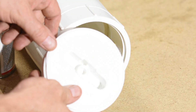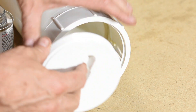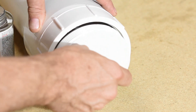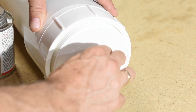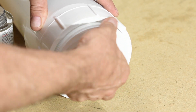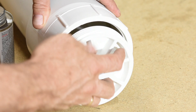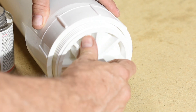Then the bottom plug — make sure you insert it in the correct orientation. Unlike conventional screw threads, pipe thread is designed to narrow and therefore tighten as you go. If you put the plug in backwards it won't go all the way, and not only will your tank not stand up, it's probably going to leak.